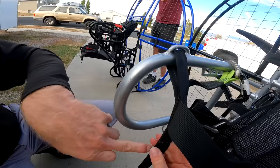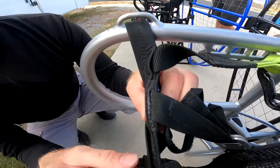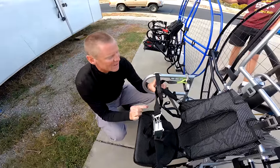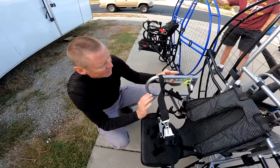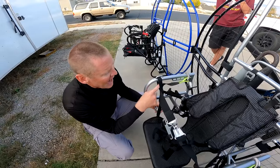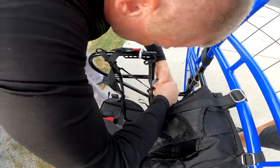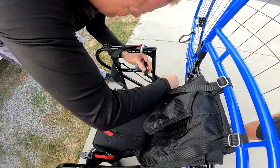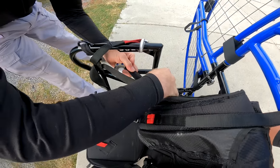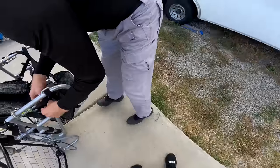With the flat top, the hook-in point is fixed and solid — it is not moving, you cannot change it away from certification. This strap comes up and back to itself, the whole thing is sandwiched and sewn together — top sewn to bottom, everything inside. You have two pieces of strapping, not one, and it's way beyond twice as strong. Trying to adjust the competitor's buckle is nearly impossible because the velcro is sewn and terminated with a lip sticking up so it won't even slip through the buckle.